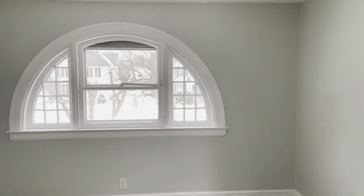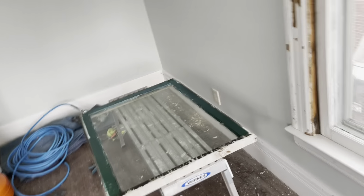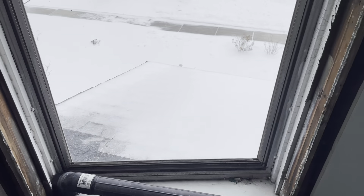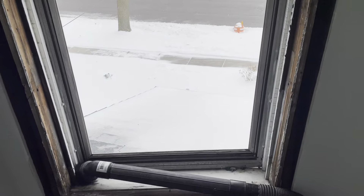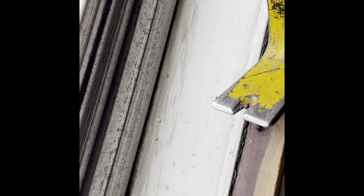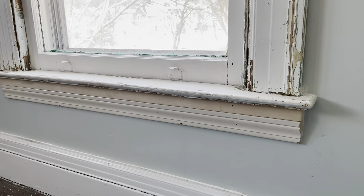This is the other front bedroom upstairs. This window is much different. With this window out, I'm going to clean out this whole area down here and make sure that the retrofitted storm window is properly seated. Over the years they jump track sometimes. Sometimes these little nails here don't give themselves up easily — they don't always give themselves up with a wonder bar. For this window, the stool didn't survive the demolition process, so I fabricated a facsimile.